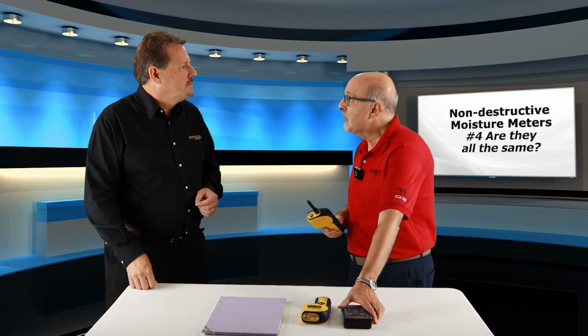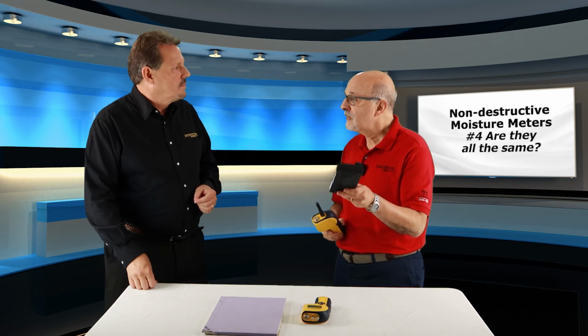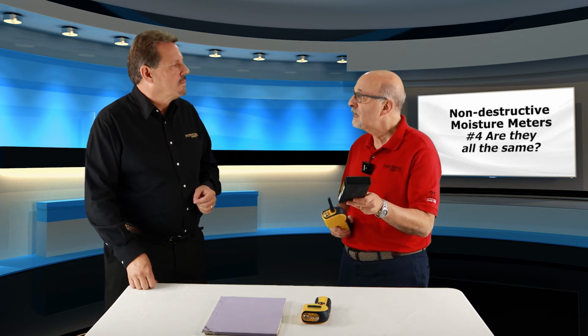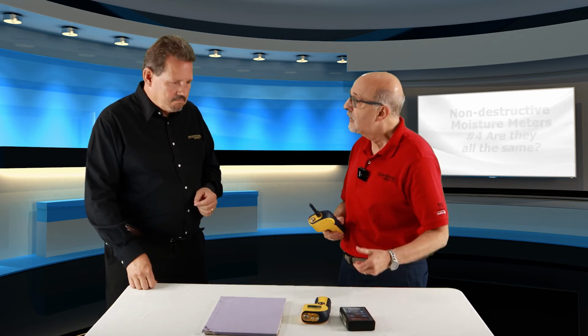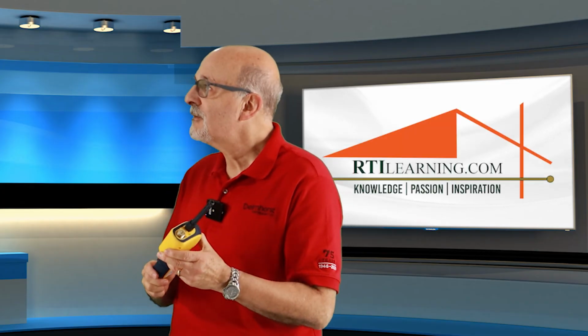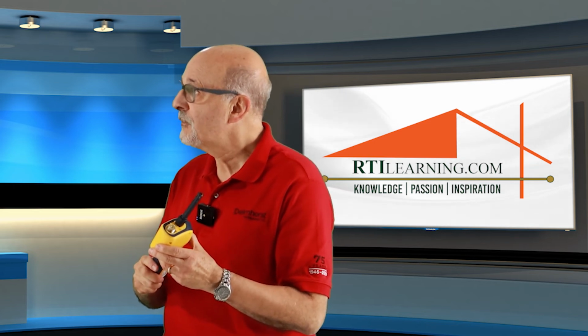For example, even within the same brand of meter, the ProScan here is a tuned capacitance circuit that's meant to accurately measure the moisture content of wood and give you relative readings on non-wood materials, whereas a meter like the TechCheck is ideal for quick surveys to help you find out where your high moisture spots are.